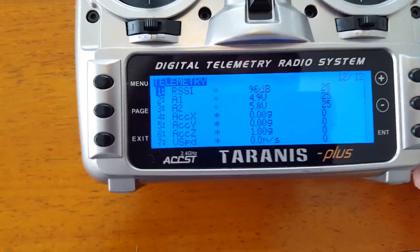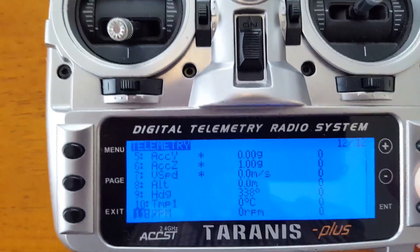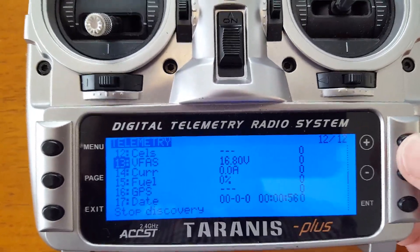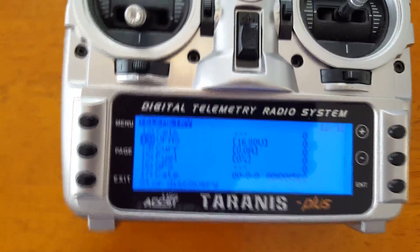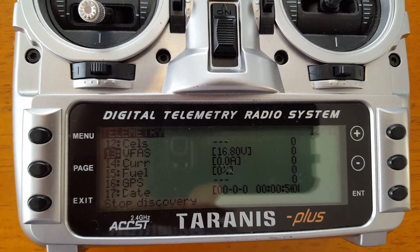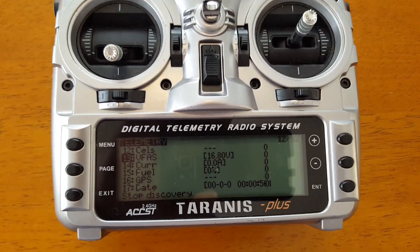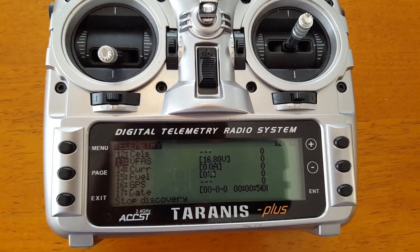This is what you should see — now you're getting all of the sensors that your Acro Naze has available to it. Once that's done, the Taranis remembers what sensors are there. Your voltage for your full pack is there — you can see it's 16.8. They do say you may need to adjust the actual voltage reading because it may not be accurate. They recommend you use a battery meter to adjust an offset on the voltage so that it is accurate.